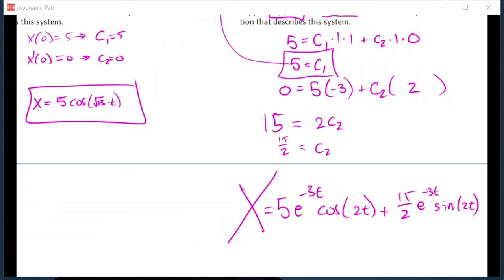I can add energy by just, if you can imagine me standing on that elevator out there holding this and then pressing start, and the elevator moves up, that is actually adding energy to the system in a sense. So that would elongate the spring for a moment, and then when I got to the second floor, it would stop elongating it, and I would end up with this nice motion. So even if it was at rest, once you add some energy to the system, you end up with what's called driven motion, because you're adding some sort of a forcing function, adding a force to the system.